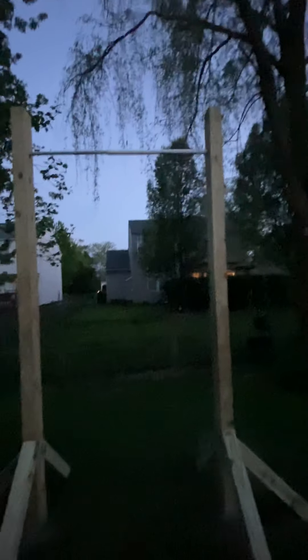I'll show you this hole over here so you can see the concrete down there — three bags per post. I debated on whether to use foam. I watched a bunch of videos on YouTube and just didn't feel that the foam would support the weight of the beams enough, so I went with Quikrete as opposed to the K2 post foam.